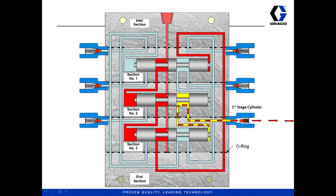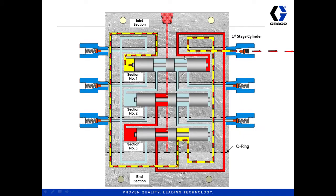So now on this one — the left one — you have low pressure here and high pressure here. So what's going to happen to this piston? It's going to start shifting to the left because this pressure is pushing it leftwards. And now this flow works its way all the way out to the right side of that first section.